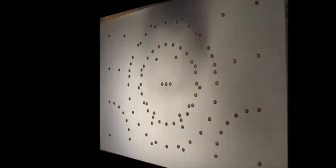The center hole set divides 360 degrees in 15-degree increments, with 2 sets of 22.5 degree angles. Using the 22.5 degree arc as a zero reference, you can create any angle in 7.5 degree increments.